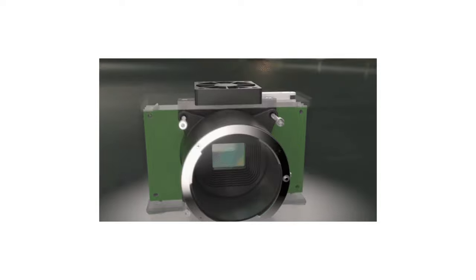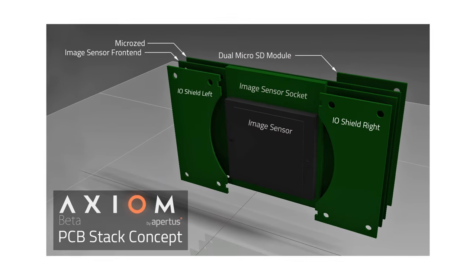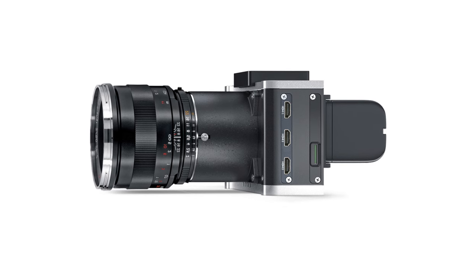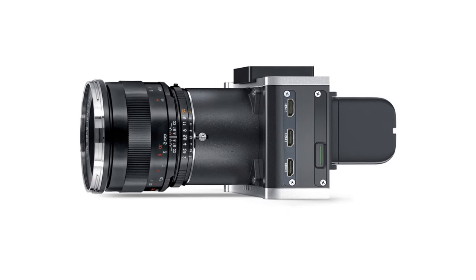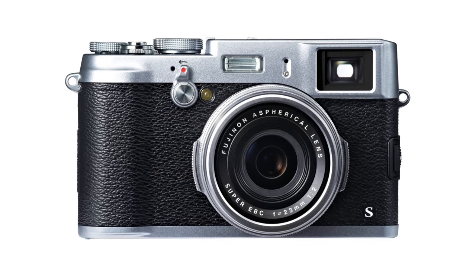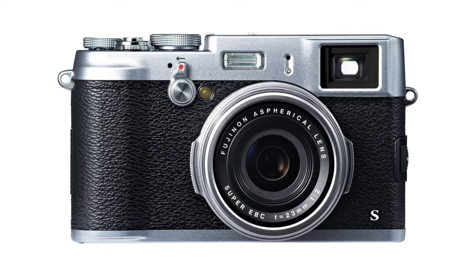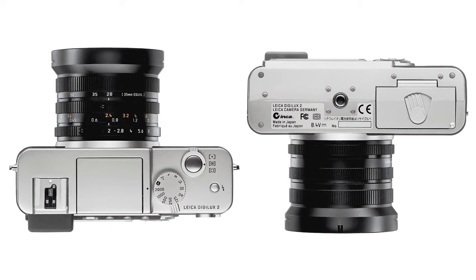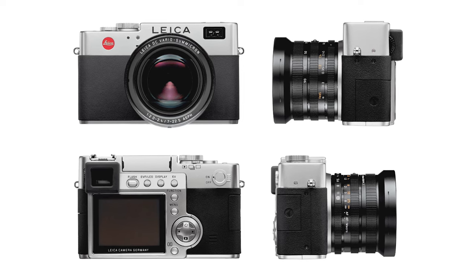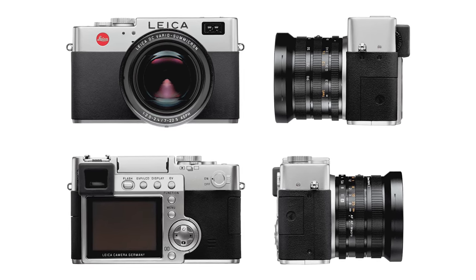First let's look back at what we showed in crowdfunding. The PCB stack was actually much simpler at the time — just three boards. The dual micro SD module depicted in that concept was scrapped after the campaign and integrated into the power board. The general enclosure design concept shown in crowdfunding was based on or inspired by small form-factor compact photography cameras. Design elements typically include very monochromatic material and color choices — silver, white and black elements — with details in different surface finishes or gradients created by beveled edges and curves.